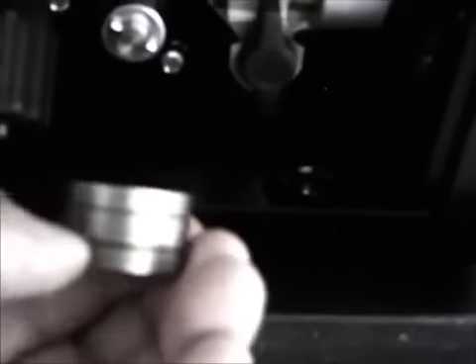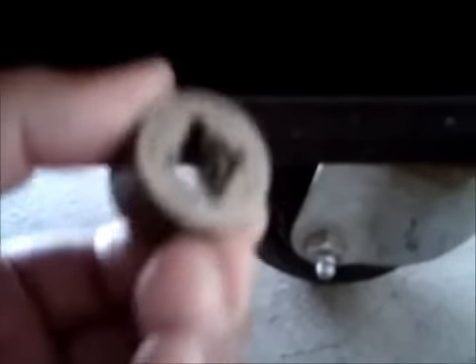We've got 0.023 wire inside of this. The wire is mounted there — it's a counter-clockwise rotation nut that holds the spool in place. When you change wire sizes, like from 0.023 to 0.030, you put this lever down, your roller goes up, and you push and turn. It has two grooves: one for 0.023 wire and one for 0.030. You can see it says 0.024 — 0.023 and 0.024 use the same groove. On the other side you're running 0.030 or 0.035. So running 0.023, we put it on the 0.024 setting.